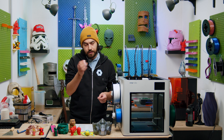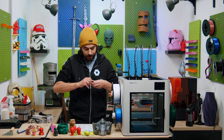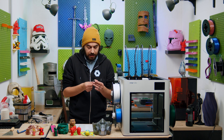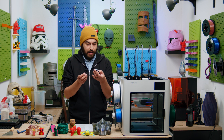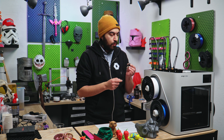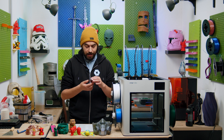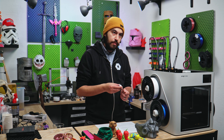The hotend is pretty familiar. Everyone is copying the Bambu-style hotend with the low thermal mass block and kind of vertically stretched out heatsink. It's a great hotend design — it dissipates heat really well with minimal airflow and it heats up fast. It's 300 degrees maximum. The printer comes with stainless steel nozzles as standard, so I really wouldn't recommend using abrasive filament on this until you get the hardened steel variant, which will be available.